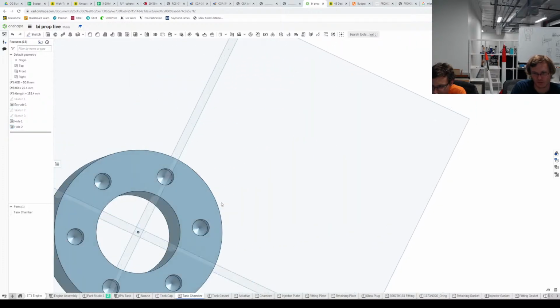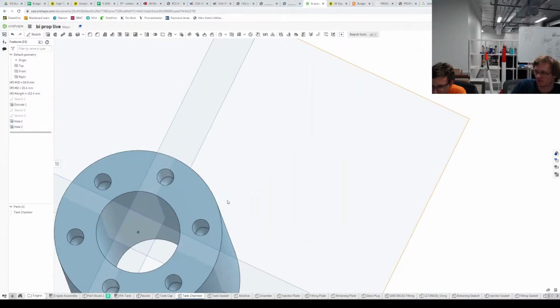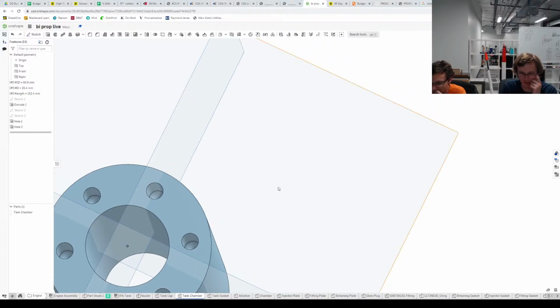Right, we want to drill and tap, because if we drill them and tap them and they're not the right size, for example, for those bolts, and we bottom out the threads on the bolts, well, you can't really re-drill the hole and make it deeper because you'll destroy the threads that already exist. So then I will cry. There will be crying. So I'm just trying to eliminate that from happening.